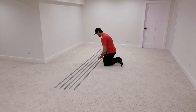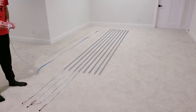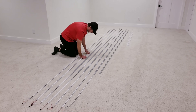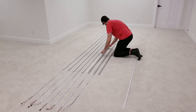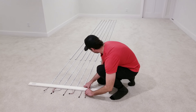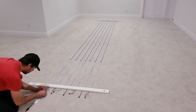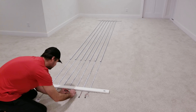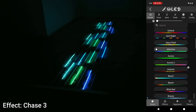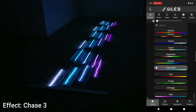Finally I'm going to set everything up using my favorite diffuser channels from Azada. This profile eliminates hot spots for any strip with at least 60 LEDs per meter, and importantly it offers two meter length sections, which is much easier to work with on larger builds. I'll set everything up so you can see demo footage of how things look with and without the diffuser channel, leaving one meter of each strand outside the profile. I'll connect the same power and controller to the beginning of the first strip and connect the LEDs in a serpentine manner. I hope you enjoyed this experiment and came away with a new understanding of how simple this can be for certain use cases.